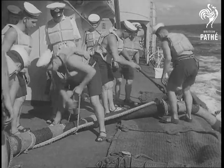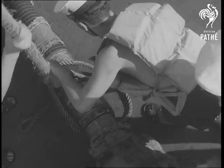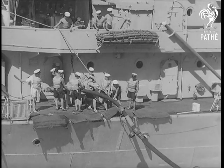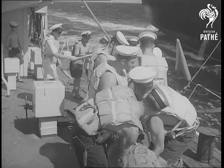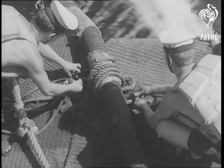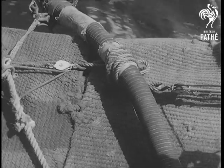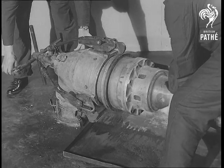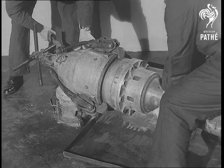The outer length of the hose is then cast off from the hose line and the hose end is taken to the fueling point. It is most important to avoid chafe, so two light tackles are rigged on the hose to prevent its sawing fore and aft in response to the ship's movements during fueling. Connection is made by fitting the male unit of the self-sealing coupling to the female unit.